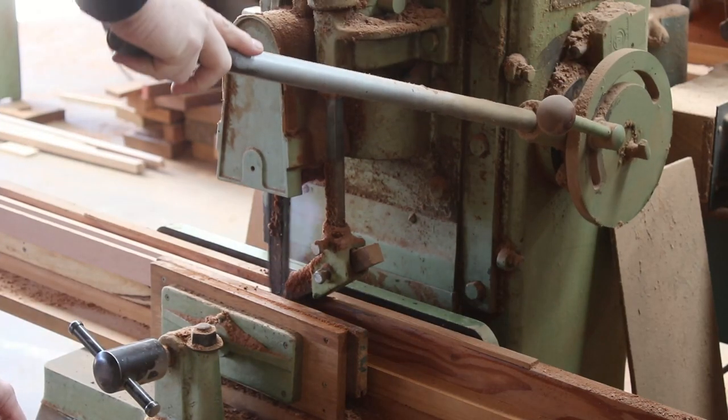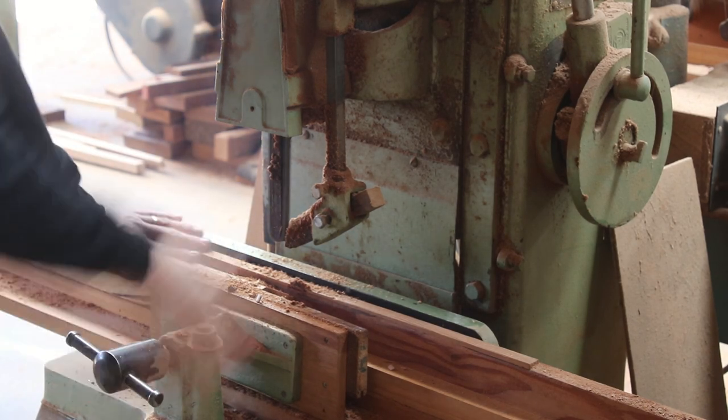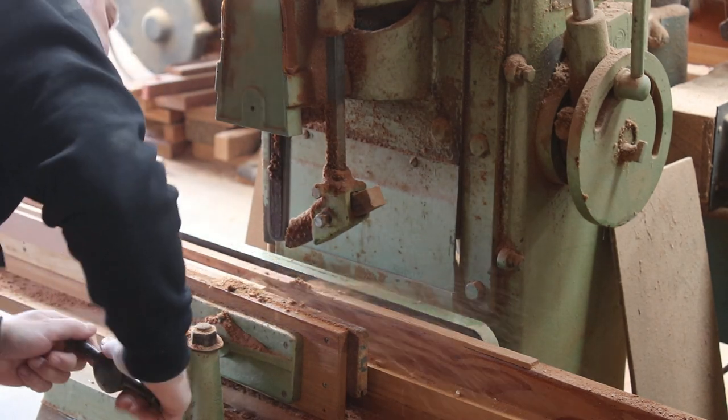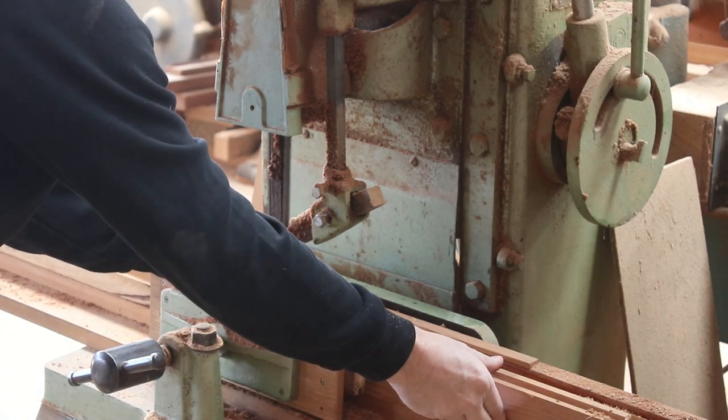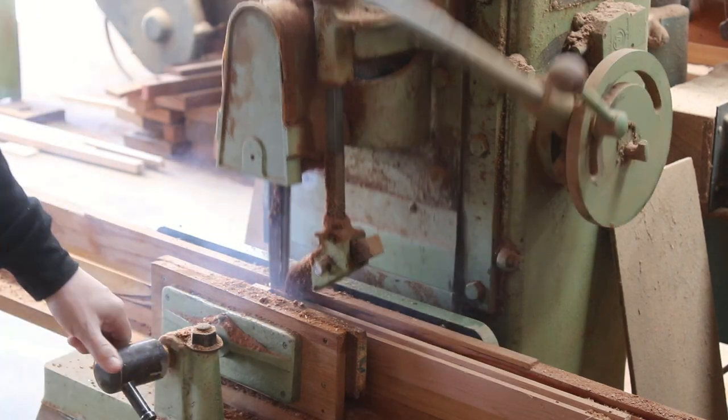We start off on the mortiser. This sash has a 45mm or 1¾ inch top rail, so it has to be a bridle joint. Whilst the bottom rail is 3 inch or 70mm, allowing us to do a traditional mortise and tenon on that one.